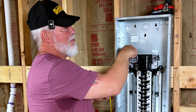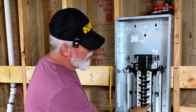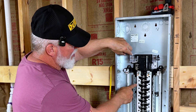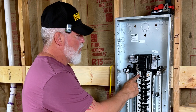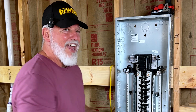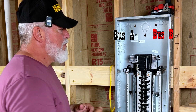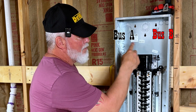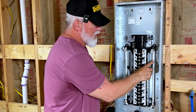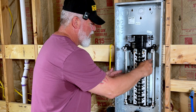You're going to have three basic wires coming in: a black, a red, and a common. I have what are called bus bars — this is a bus bar, this is a bus bar, this is a bus bar. The black wire comes in and ties here, feeding into this side, and each one of these slots will provide 120 volts on bus bar A. Bus bar B comes in on this side with the red wire, and each one of those slots will also give you 120 volts. The common, which is the big white wire, ties in here and goes down this bus all the way down, with a bar that carries it to the other side — so this is one big bus bar.